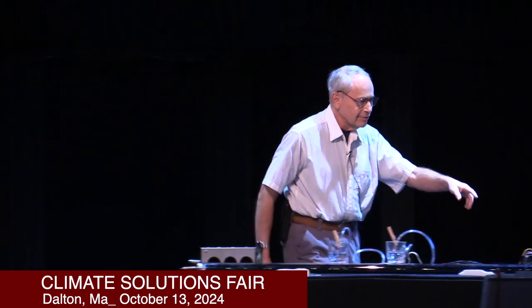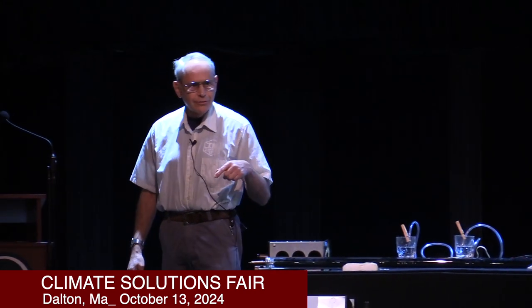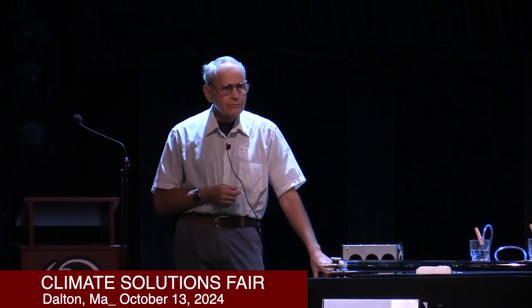What's the battery type? This is a lead-based battery. I have seen lithium batteries in houses also. This is a sealed lead battery. I've seen flooded lead-acid batteries too — I have flooded lead-acid batteries at my home, and I add distilled water every few months to keep them operating. When my house was built in 2008, before I moved in, there were batteries there for backup for the heating system. Lead or lithium, either one works — there are times where one is better than the other, with pros and cons. Depending on your unique situation, you get the one that fits.